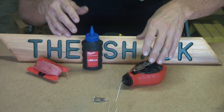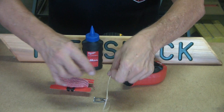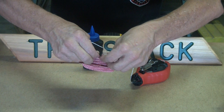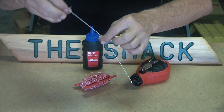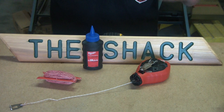This is everything included in the kit. A lot of times when you buy a chalk reel, you'll have just the reel and the chalk. This was a bonus kit that actually came with an additional chalk line — the 1.5 mm chalk line. Pre-spooled on the reel is the 0.9 mm. You can see the red line is much thicker than the white line. This is the thinner fine chalk line, and these are braided lines which hold together better over time. They won't start fraying, fluffing, and doing all that weird stuff.